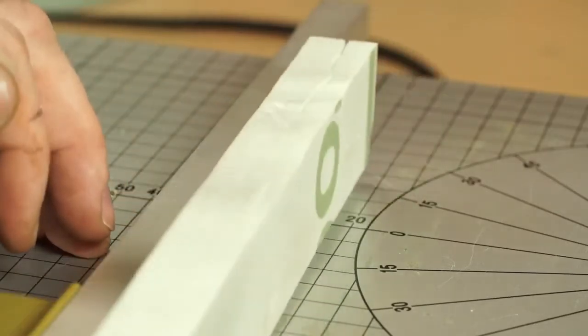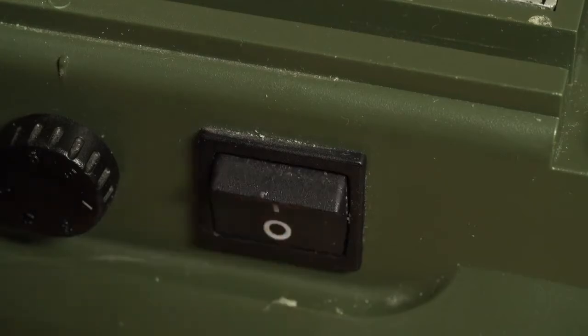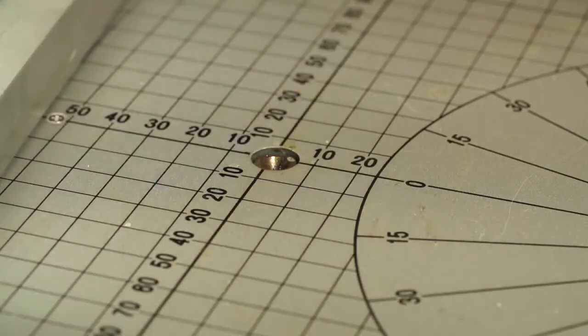With any foam cutter, it is inevitable that you will break the wire. Fortunately, it is easy to get it restrung and back in action. Simply remove power, loosen the hold down knob in the front of the machine, and pull the old wire out.